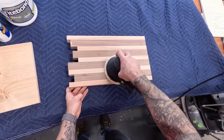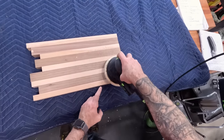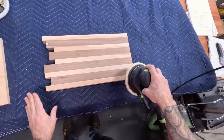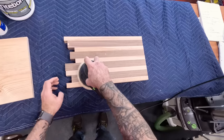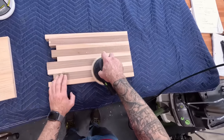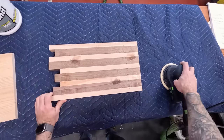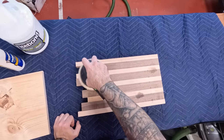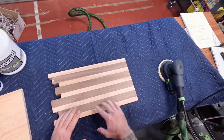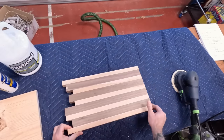I'm going to be careful about how I apply the sander. I don't want to be all on this surface because it tends to kind of tilt up ever so slightly. What I'm going to do is sort of focus the center of my sander on this piece, trying to keep it nice and level to work it down, and then I'll move off of the piece onto the rest of the board. That's looking pretty good — should be able to flip and sand the other side now. I still have to make a couple of cuts and do a little bit of shaping, so there's really no reason to do the final sanding just yet.